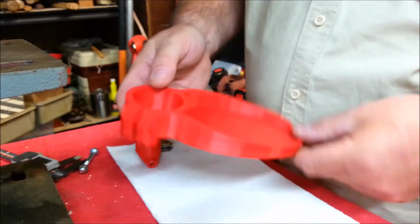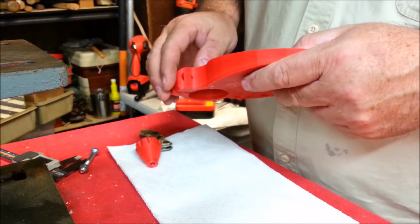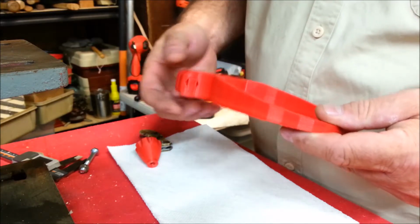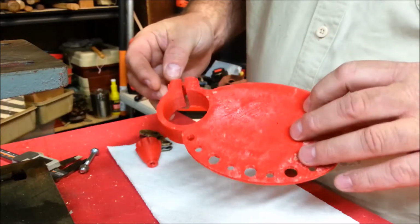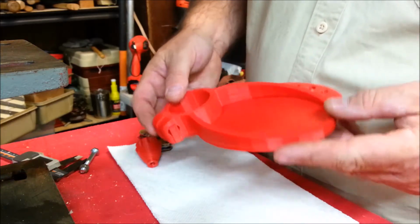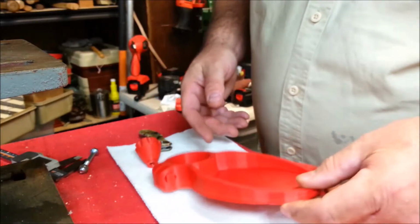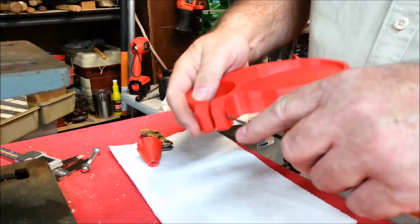And I felt this plastic here was unnecessary. I radiused it down. You can see I've got a bevel here, but I didn't put this radius down here because we'd have to build a support structure to hold it up. It might look a little nicer, but I don't like the areas where the support structure is. It's just more work to tear off and not cosmetically really nice. But yeah, beautiful part. Happy with it. I'm going to weed this one out and get it ready to go.